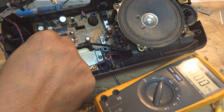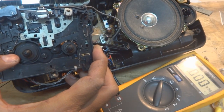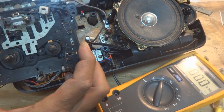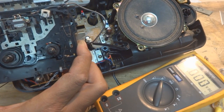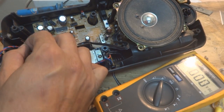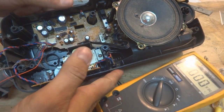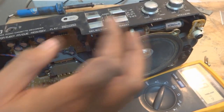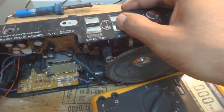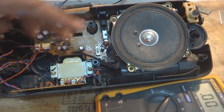Switching on a function, you can see the mechanical kit starts running — the machine is working and playback is functioning. However, there's an issue with a loose belt, so playback quality isn't great. When I switch to radio mode, I get nothing from the speaker even with the volume at full. So either the speaker is bad or there's a problem with the amplifier.